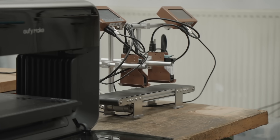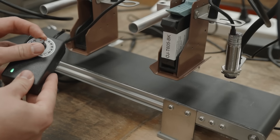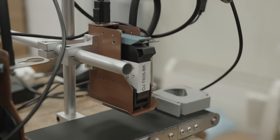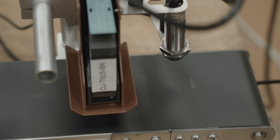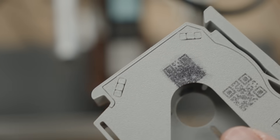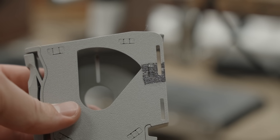But before going through all of this, I first tried another approach. I came across a small conveyor belt printer with an inkjet cartridge mounted on top, normally used to print barcodes or expiration dates onto products. It came with a small conveyor and would be much better to automate. However, even after experimenting with different inks, cartridges and settings, I couldn't get close to any satisfying result. The ink is too thin and the capillary action of the 3D printed layer lines instantly draws away most of the ink, producing an interesting but unwanted appearance. We treated the surfaces before printing and even preheated the parts so they would dry faster. Things improved a tiny bit, but it was just unsatisfying, which ultimately led me to go back to the Eufy Make.